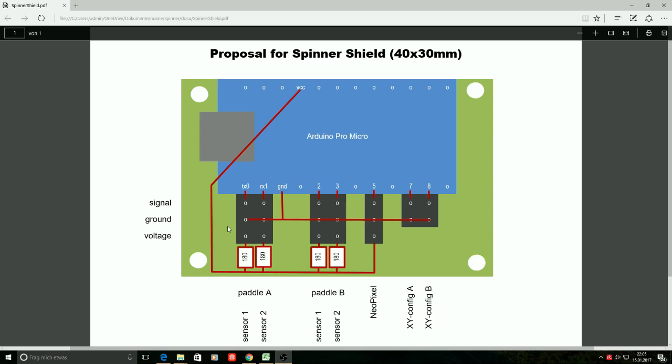The internal LED of the optical sensor needs, of course, some power, some voltage. Unfortunately, the voltage is at a different level than the level of the Arduino. Arduino has 5 volts here on that pin. That 5 volts needs to get connected to a 180 ohm resistor to get the right voltage for the internal LED of the ITR9608 optical sensor. So that's basically the pin on the lower row in this illustration.